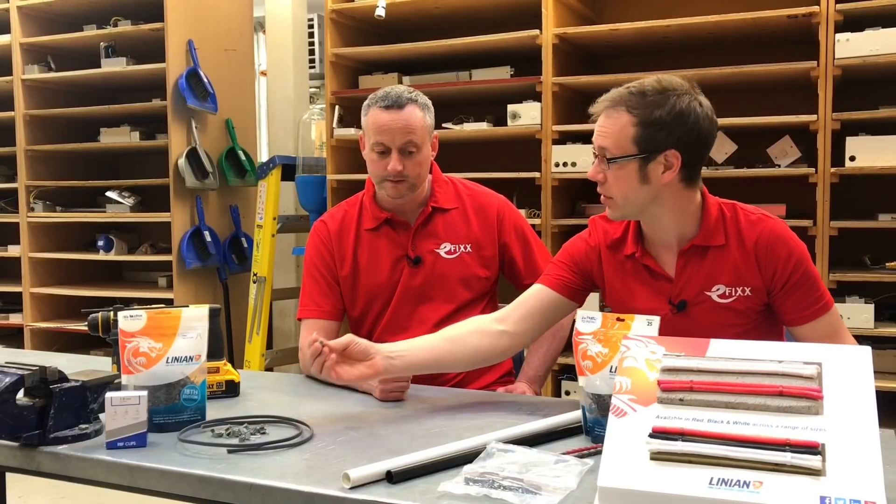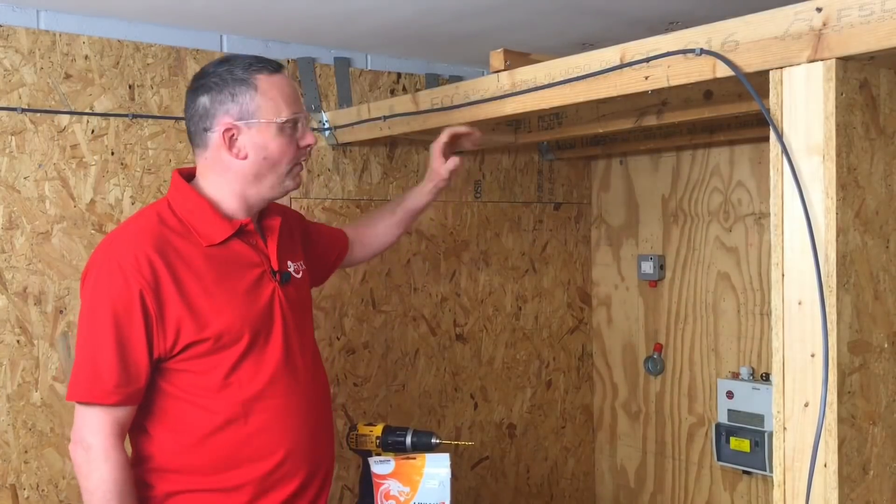If we're just using plastic clips and a fire breaks out, that cable can fall off the wall and cause serious problems — entanglement. We're looking at people trying to exit the building becoming entangled in the wiring system, but more often it's the concern of fire officers entering the building once it's ablaze and becoming entangled while rescuing people. BS 7671 doesn't specify a time period — it just requires prevention of premature collapse.